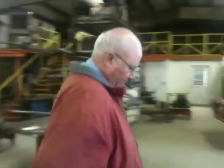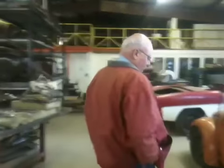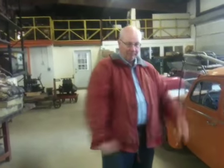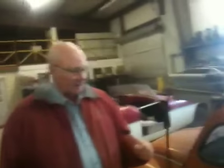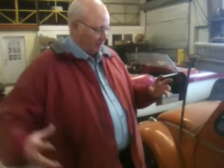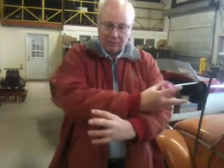The question is, how do you get all the heat out of that hot gas? There's any number of ways of doing it. You want to get the hottest flame at the hottest water. That's correct. Counterflow. Now, some people, for example, this Volkswagen has a boiler that's like this, but it's laying on its side. They seem to be comfortable with that. The flame goes this way and the water goes this way.